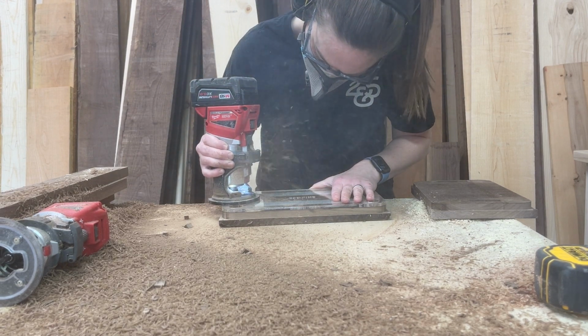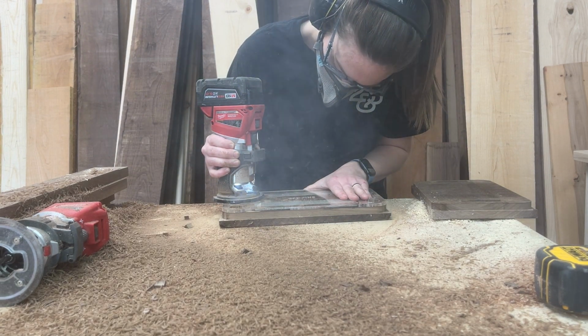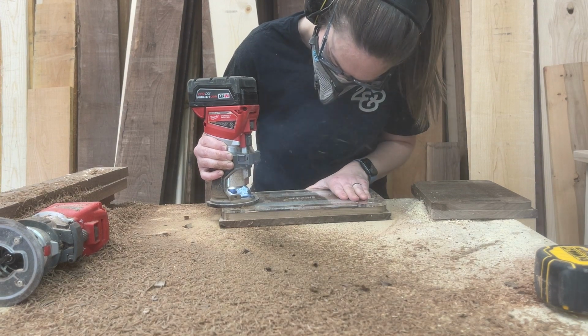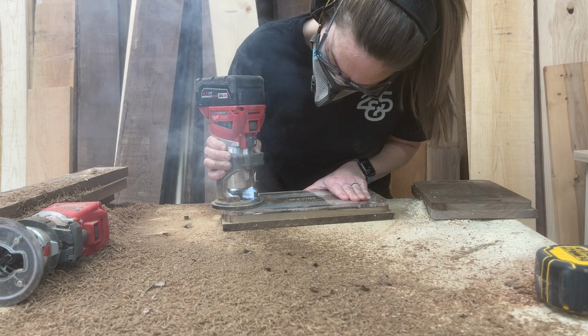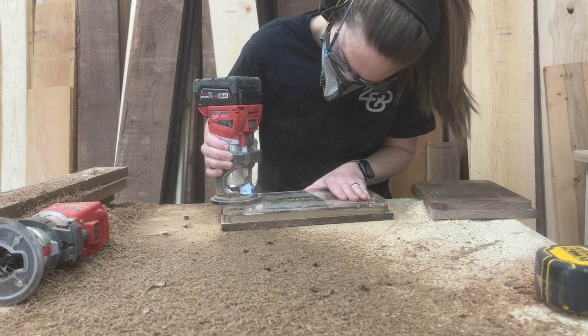To do this, you'll want to carefully plunge the router into the cutout space. Carefully move the router around the area using the guide of the template to carve out the shape with your hand router. You'll do this with all 4 pockets if you're using the dowel, or both rectangle pockets if you're using the rectangle legs, on both the top and the bottom faces of the table.